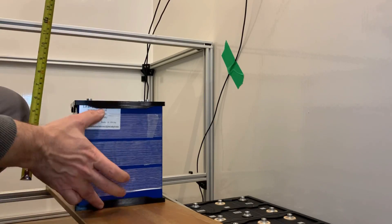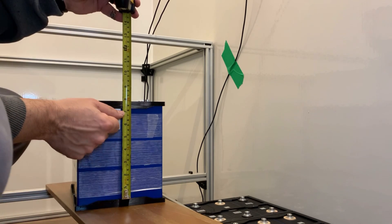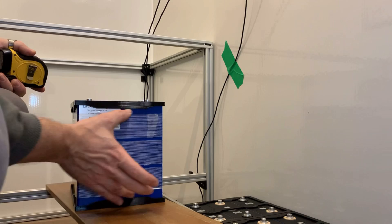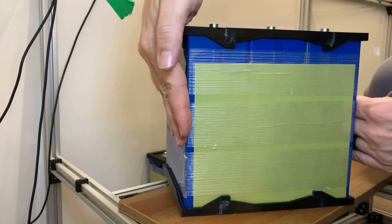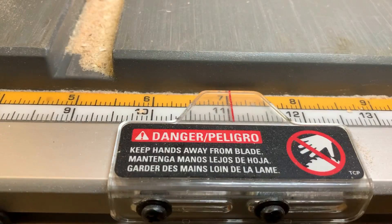The space between the upper and lower battery trays is about 180 millimeters, or a little over seven inches, so the strip of cutting board will run through there and the threaded rod will run from front to back to keep the plates pulled together. This is also why I put fiberglass on the sides of the packs as well as between the cells — just a little added protection for the threaded rod running between them.